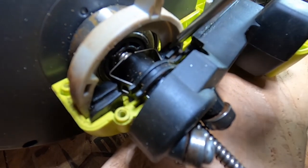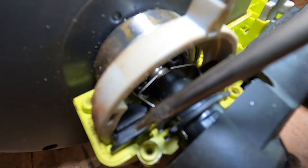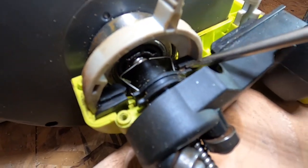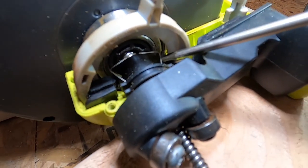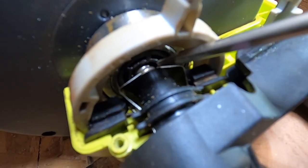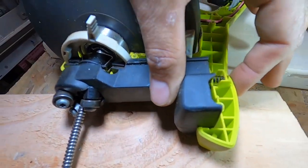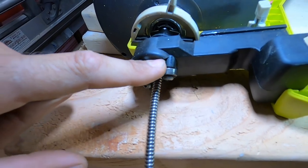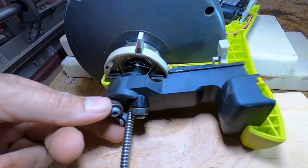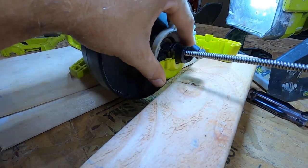This little black thing popped out, but I just put it back. You have two of these little black things right here. Whenever you turn this clamp and engage it, it pushes these two black pieces and puts pressure on these two pieces of metal, which clamp down on the wire. The auto feed feature works by pulling up on this black handle portion, which puts tension on these bearings. Then you engage this switch. That spring right there is what keeps it down to keep it unengaged.